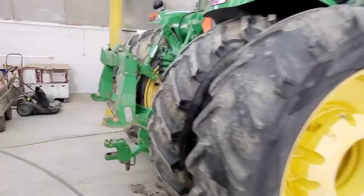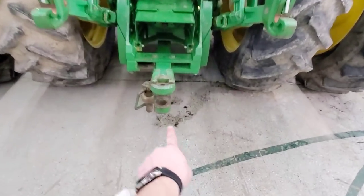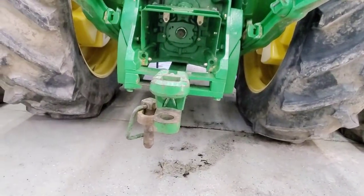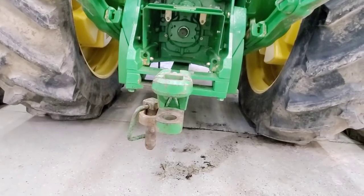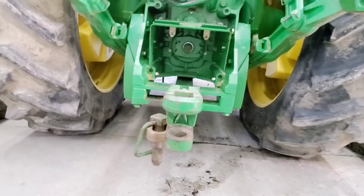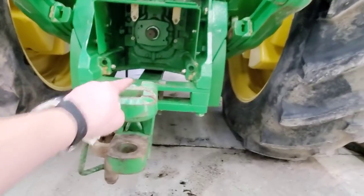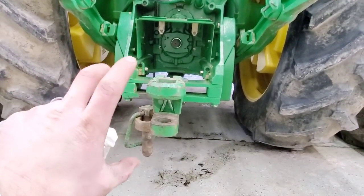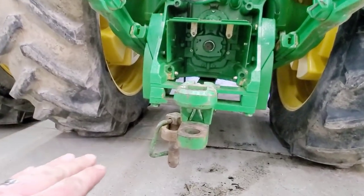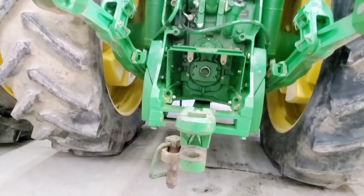It occurs to me that some of you probably don't know what a three point hitch is. So if you look at the back end of a tractor, down here is the draw bar. This is how most of your implements — especially tillage and wagons — are going to hook up to the tractor. It'll have a tongue on it that comes in here, we put the pin down through them, and they're attached that way. Sometimes implements will have a top and a bottom clevis, in which case we'll take the top off of this because you only want a top and bottom clevis on one side — either the tongue of the implement or the tractor has to be a single lip and the other has to be double so that you have a good connection.